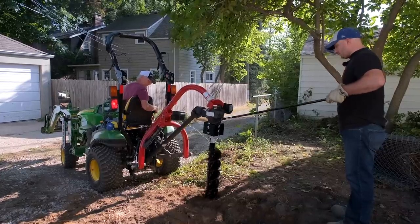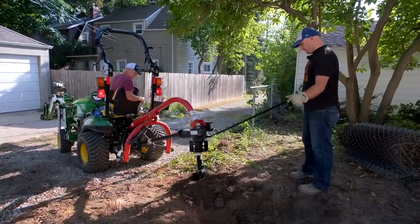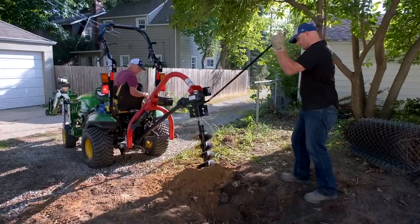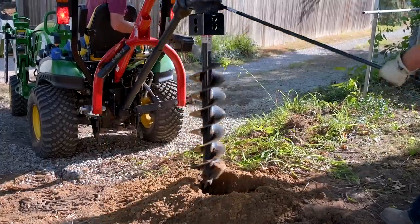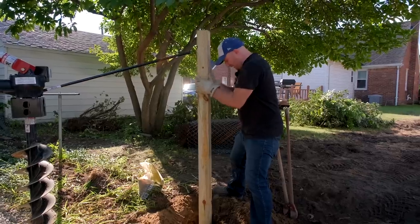We'll also try to be tackling the parking spot in the back and maybe moving some of the 6A limestone to the alley to start putting down to clear up the driveway. So we have to cut out some of the dirt in that back parking spot, put some felt fabric down, and then put some limestone on top of that, build up like a 3-inch base. That's about it.